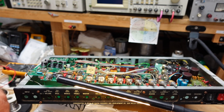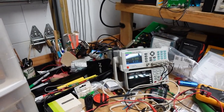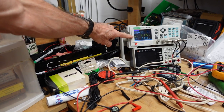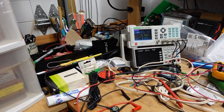So when I put this one on the meter, it's better ESR, but less capacitance. It's supposed to be, no, actually, I stand corrected. That is microfarads. So this capacitor, got some glare here, let me just drop this. This is reading about half the value, 4.5 microfarads and 6 ohms of ESR. Still, I'm going to replace all of them.